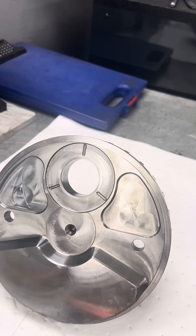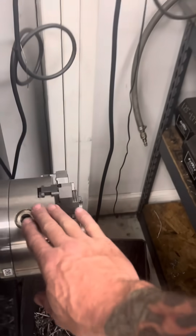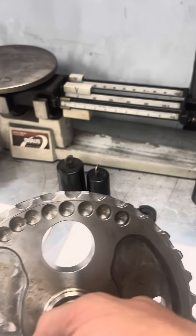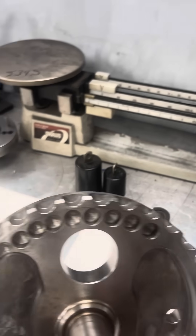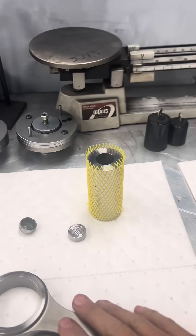So you get a lot of vibration in your motor. So we put it in our balancer machine, we spin it over here — it tells us where to drill and how deep to drill it. And we end up taking material off of this end to counteract the weight of the heavier, better-built products from the factory.